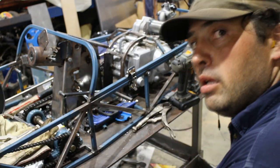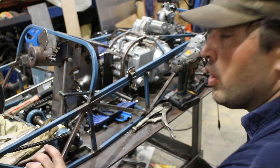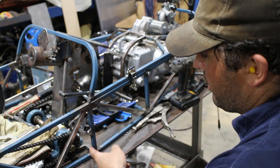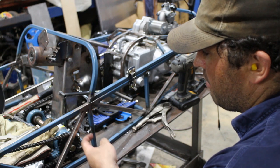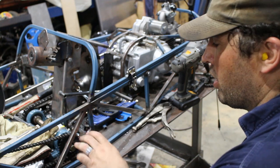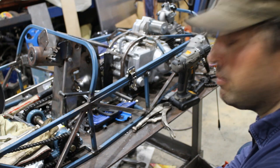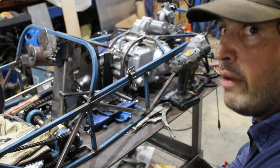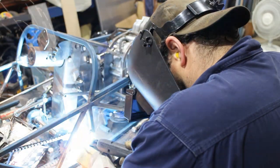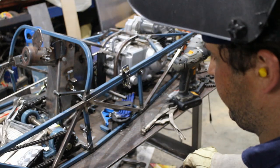That's the bonnet catches. Since I'm over this side, I might as well finish off the exhaust mount for the bracket to hold the muffler. So what I gotta do there, weld another captive nut on down the bottom here, and then make a bracket that'll bolt in there, and then have a special shape to it so that I can put a big stainless clamp around the muffler itself. Well, that's the plan anyway. That should do it. Now I need to make a bracket.